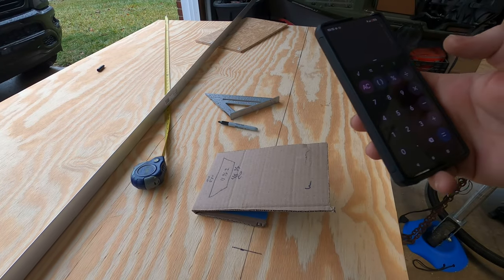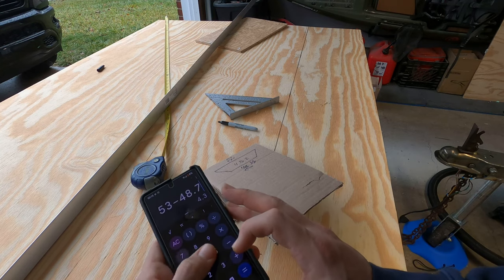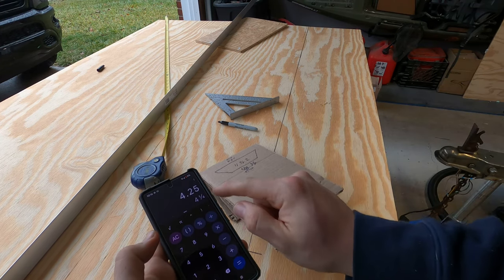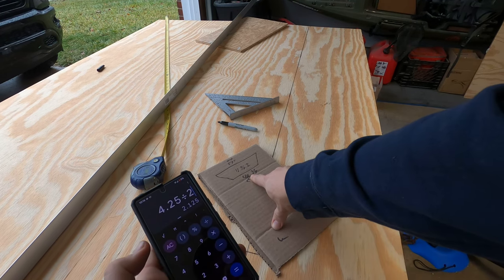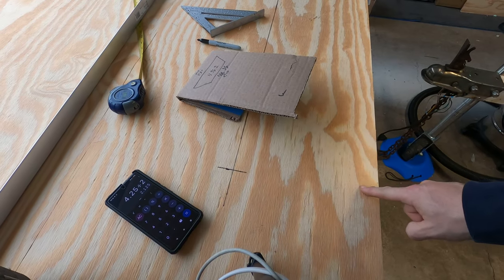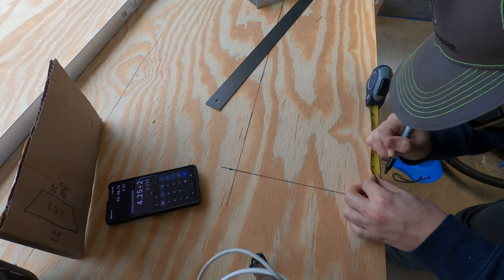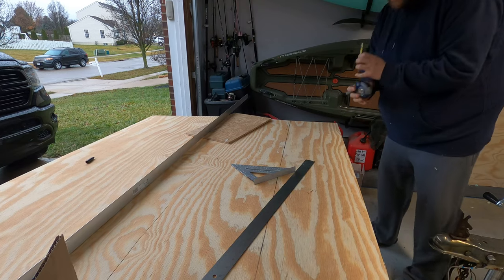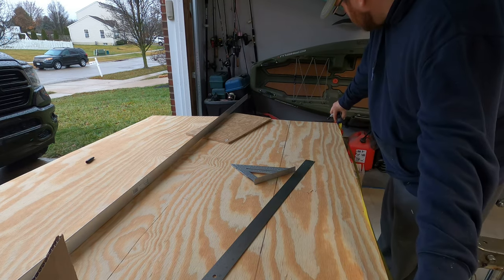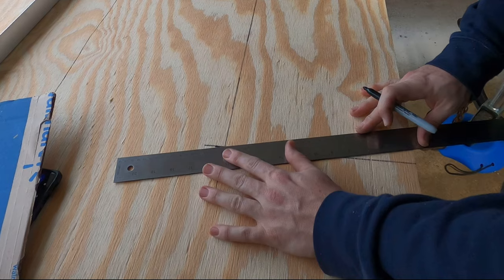There's a lot of things I excel at in life, but unfortunately mental math is not one of them. 53 inches minus 48.75 — we're at 4 and 1/4 inches difference between the top and the bottom. Take that and divide by two, that's 2.125, so two and an eighth. What I can do is draw this line straight down and then come in two and an eighth on each side — that should be our bottom width. And these two measurements should measure out to 48 and 3/4. Perfect.